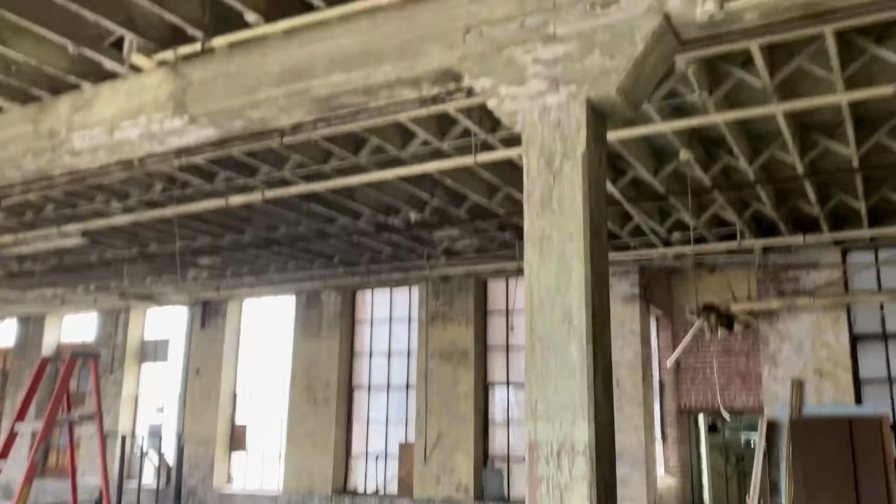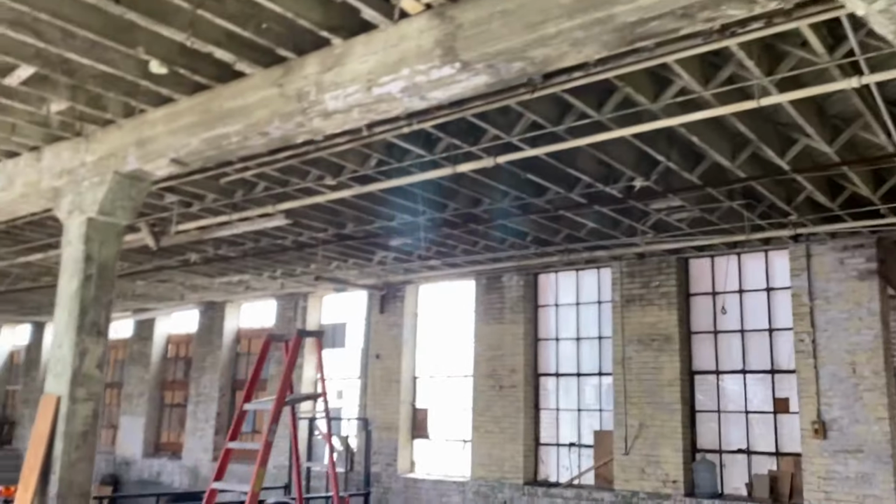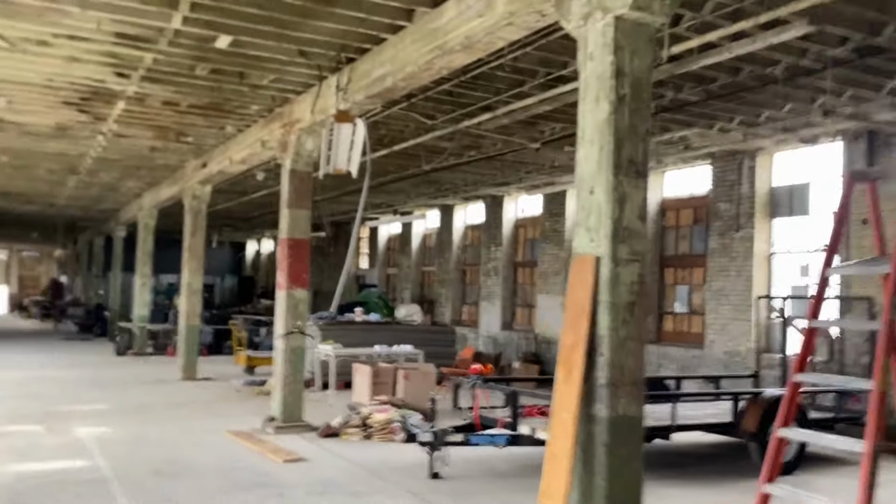And right now, I just need to do the measurement to see how far it takes to get to that elevator shaft, and then add 50 feet for the vertical rise. So it was pretty easy math to do, because on center between the posts is 18 feet, and then it was easy just to count how many posts there were.